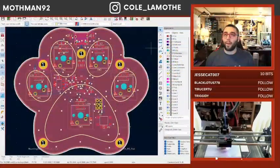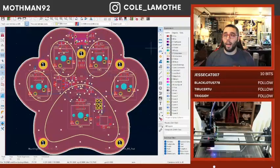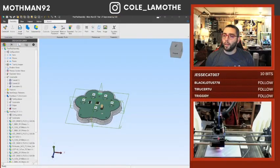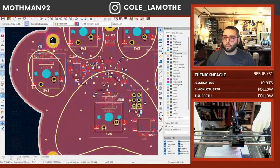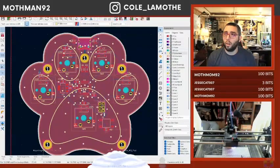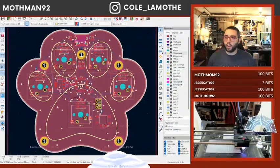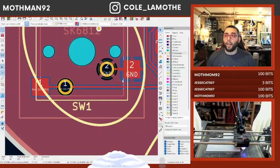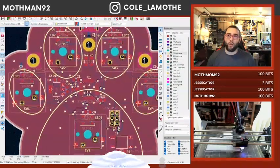This is basically where we left off last time. Since then I haven't touched KiCad, I haven't looked at the PCB. We're working our way through QMK. Here you can actually see that we have both a flat pad and a hole — the flat pad is for surface-mount soldering key switch sockets, and the hole is for direct soldering key switches if you so chose.